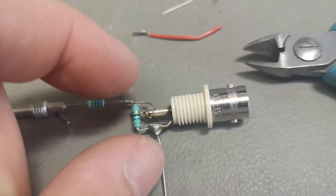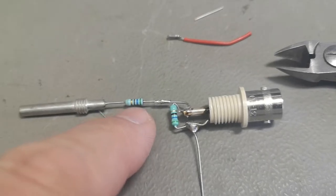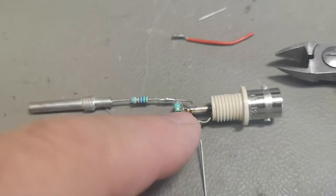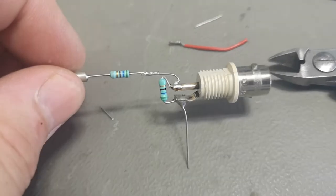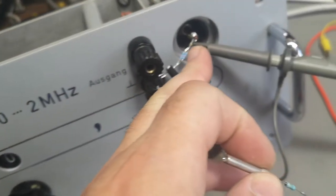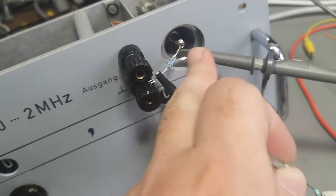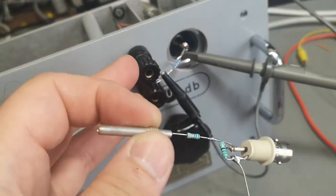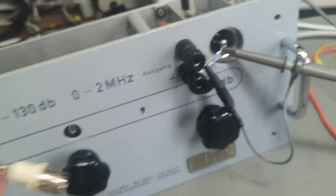What I'm trying to do here is build a resistive impedance converter that works all the way from zero hertz. So 56 ohms is a little bit more than 50, which means when I get here I've got 560 ohms — so this one plus this one is about 600. That solves the input side. On the output side it's easy — the scope has super-high impedance, so that will be the 600 ohms there.